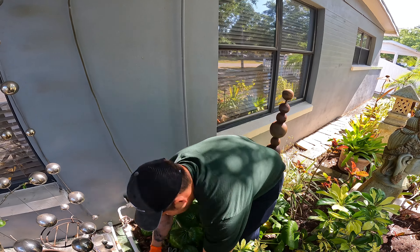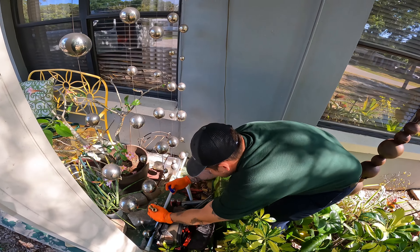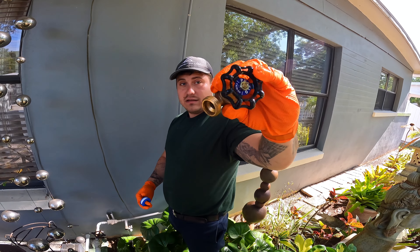What we're going to do now: I've got a brand new boiler drain. I'm going to put a couple of wraps of teflon tape around it and then some pipe dope, and then I'll just screw it right in. We'll turn the water back on, make sure there's no leaks, and that's it — that's how you replace a hose bib.